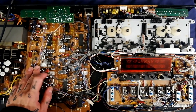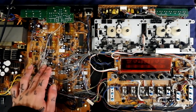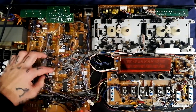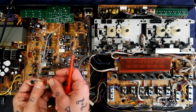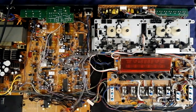I'm assuming that each one of those has the record and erase information for two channels, so that's six in total. I'm going to pry these up because some of the cables are thin and delicate. We can see that that's actually two plugs side by side. With four cables here and six cables here, that must be the record/playback head and that's the erase head — two channels, two channels.